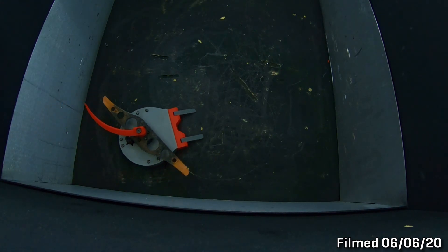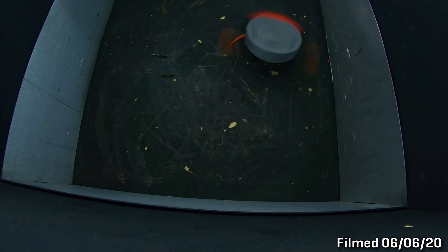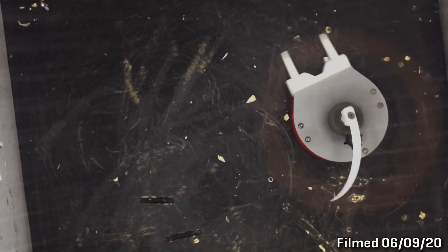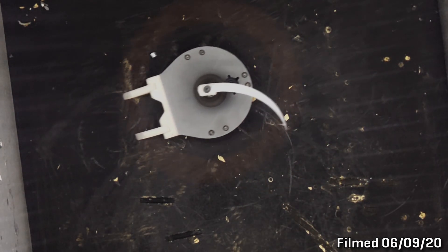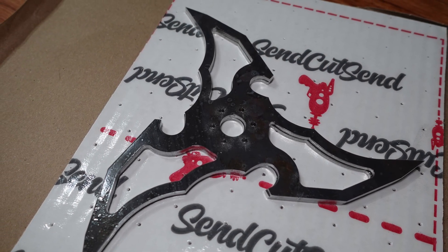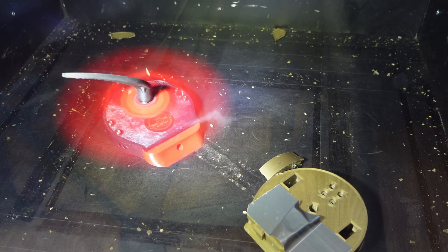This only left me with one other thing I wanted to address, which was weapon reach. I had originally designed Mini Mulcher to use a really long, thin, 9-inch long bar, but if you watch my playlist of Mini Mulcher videos, you'll notice that this caused a huge problem due to the way that physics works: if you have something that has an extremely large moment of inertia in one axis and an extremely small moment of inertia about another axis, and a middling moment of inertia about a third axis, and you're spinning it about that third axis, it basically just wants to flip upside down. The robot would just launch itself into midair and flip upside down randomly if I spun up that long bar to a reasonable speed. This was exacerbated by the fact that the weapon takes up about five of my 16-ounce weight budget. So I was looking online for some inspiration for different weapon designs that I could make another 9-inch reach version of, since the axe head is only a 7-inch reach and doesn't quite give me the low hit that I would like at the front.